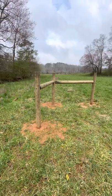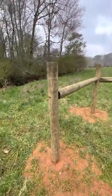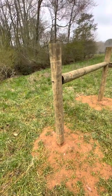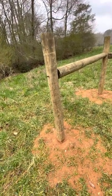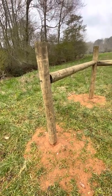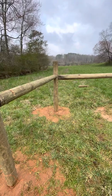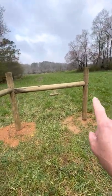Here's a corner section. What you do is put in a six-inch pressure-treated round post — six-inch by eight-foot. Drop it down about three to three-and-a-half feet. There's one there, one in the corner, and one there. Then we run these cross bracings back to the corner post.